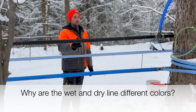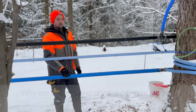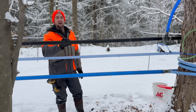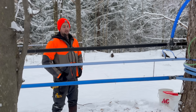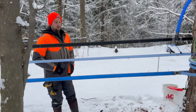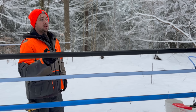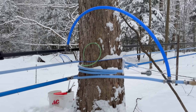I use black for the dry line. That way if the wet line is full of sap and it freezes at night, this dry line will still be empty. So in the morning when it starts to warm up again, if the wet line is still frozen, the sap has somewhere to go and will go down the dry line instead, because the black line will thaw out a lot faster. The reason they're not both black is that black pipe gets a lot hotter, and the hotter the sap is, the faster bacteria starts to grow. The blue pipe stays a lot cooler, and you make better flavored syrup that way. When everything is working properly, the dry line will be dry — there'll be no sap in it — so it won't matter how warm it gets.